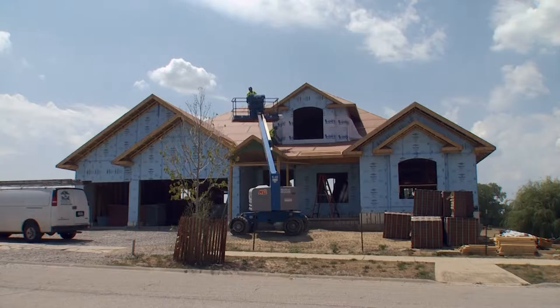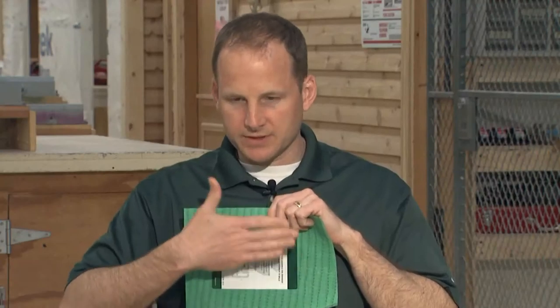Depending on your wall, you have an insulation layer in there someplace, and we like to see it on the outside now — outside of this layer. So you'll have this layer up against the house, insulation out here, and then your cladding. That seems to perform the best in every environment. There's a term for it called the perfect wall.